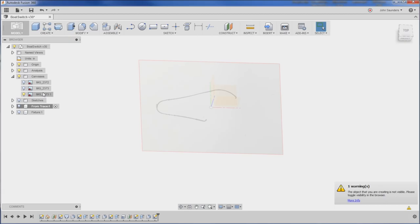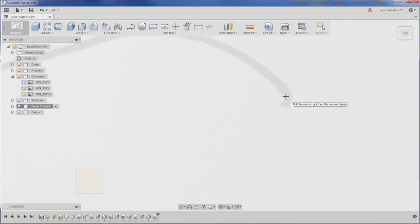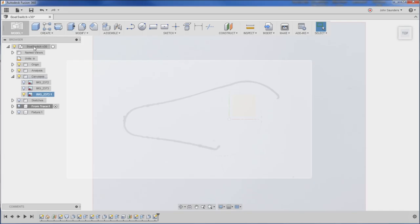What we can do is right-click and choose Calibrate. This is amazing. Zoom in, and I'm going to pick the nose and pick the point where I think my caliper was when I measured that 1.741 inches. Right now it thinks that is 0.391 inches — it doesn't have any way to know. I'll type 1.7415. How easy is that? You're not going to hold two-tenths on a part doing this, but it's gotten us out of a pinch and it worked great. So we've got this sketch we can trace around.